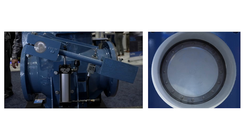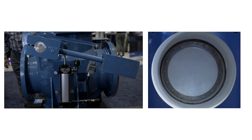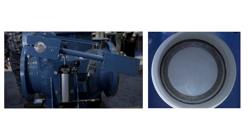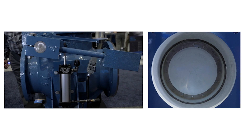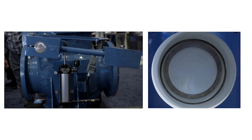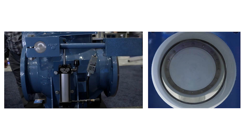When the CPC SmartCheck goes to the open position, you'll see the 25-degree full port opening of the high performance check valve. It has a stainless steel 316 seat in the body and a UHMW ultra high molecular weight polyethylene seat on the disc as standard. That seat has very high abrasion resistance and works well in both wastewater and clean water applications.